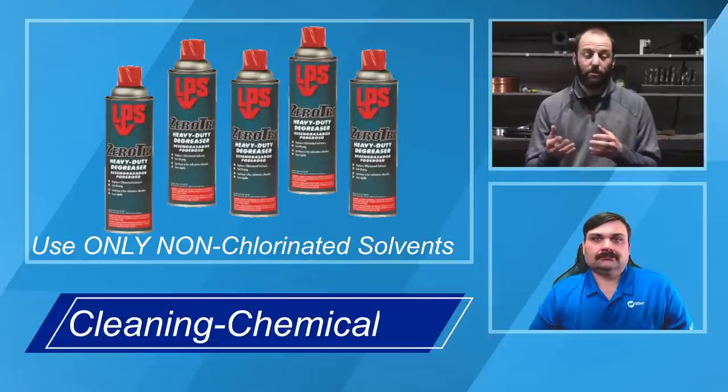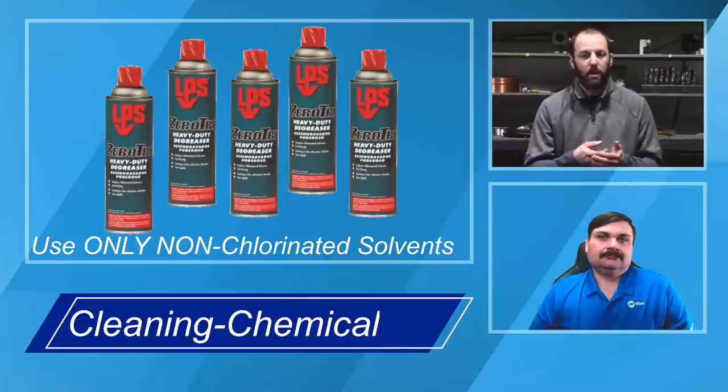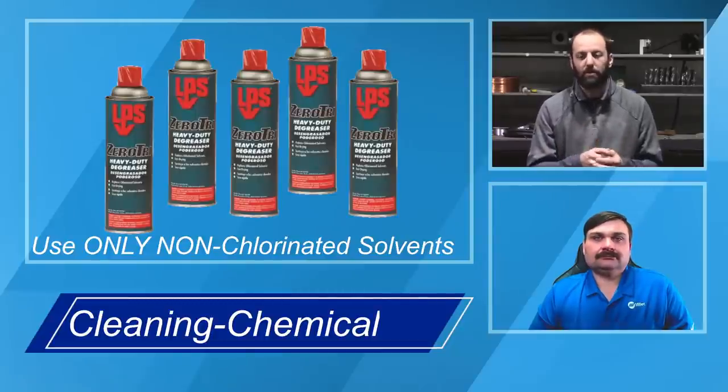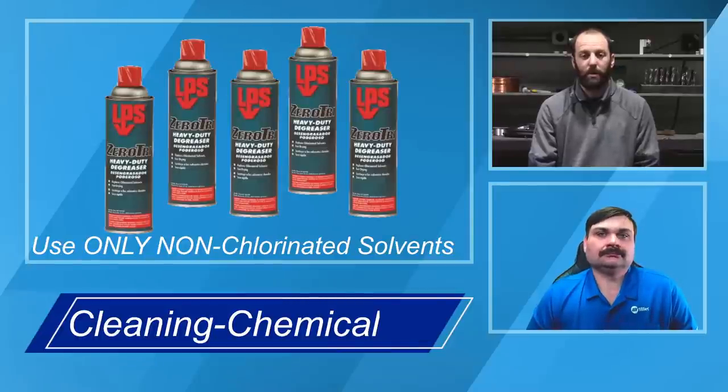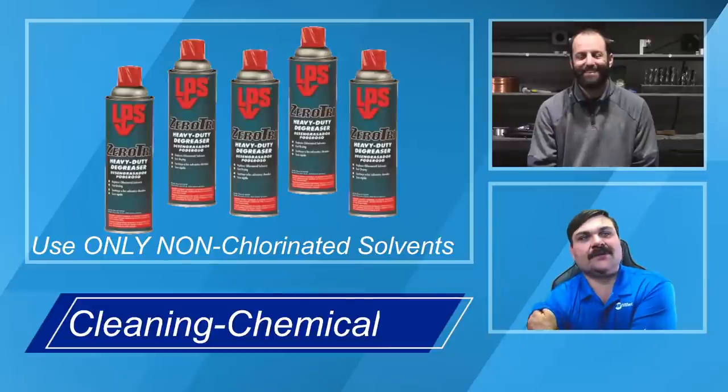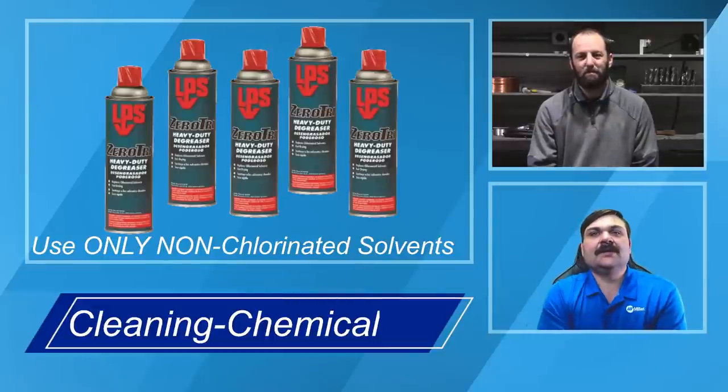Now, if you're on a farm and you've got absolutely no other option, and you're trying to weld on a part that's been in service that's extremely greasy or dirty, certainly alcohol might be better than not getting the grease off of there. It's going to act a little bit as a solvent detergent to help remove that dirt or grease. But if we have an alternative like a Zero Tri or even an acetone, that's going to be a little bit better than using an alcohol-based compound. Yeah, and that's what I was going to say. You might be trading one thing for another with the moisture aspect of it, too.